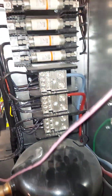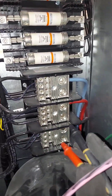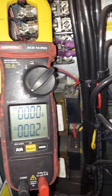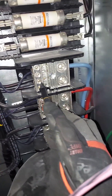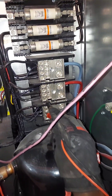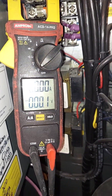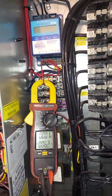Let's check our incoming power. It's three-phase — be careful. Pros only, no do-it-yourselfers. If you're a beginner, you should know to use a meter and know your way around the AC unit — this is live power, this will kill you. Checking three-phase, first pair: 210 volts, we got juice. Second pair: nothing. Third pair, top and bottom: we got juice. So we're missing a leg here.